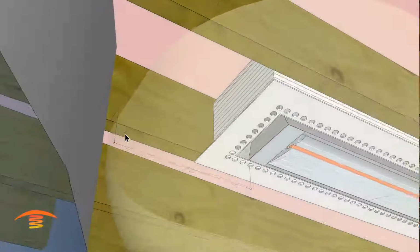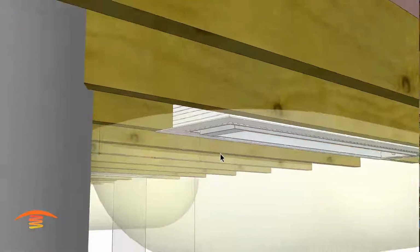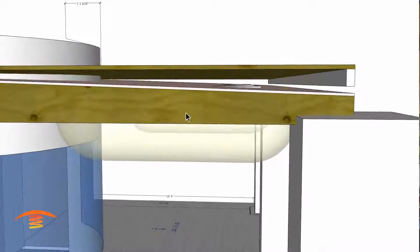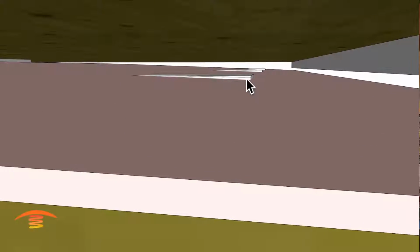And as you can see, I am not penetrating that wall at this point. There is a little leeway here because of the position of the heater in relationship to the overall structure. But the big problem I'm having is that we go up here with all of these dimensions. This piece of 1 hour rated firebox, which is 8 inches tall on the inside, plus the 5/8 obviously, is protruding 1 3/8 of an inch, I believe, higher than the bottom edge of this material.